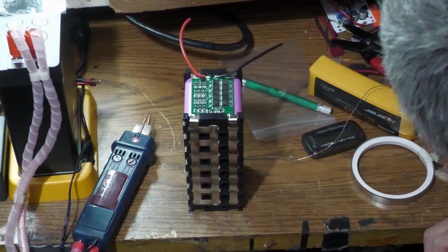And so you can get these for like $5 from China, the setup, and then I usually spend about $1 a cell through battery hookups. So you just have to kind of watch for when they have good cells available. There's 21 cells in here, so obviously that's another $21 plus the 5 plus maybe a little wire or something. So under $30, you can get a 20 amp hour 12 volt battery that you can use for all kinds of things.